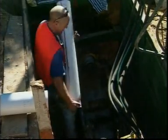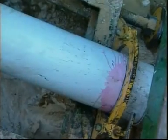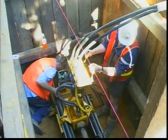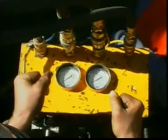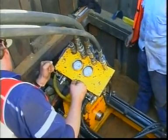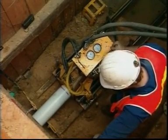No Dig Equipment can be used to install any type of pipe and services, including pipes up to 250 millimetres. The rig can be operated at any depth and in most locations. Boring can be accurately achieved for grades from 1 in 200 up to 1 in 5 and over distances up to 60 metres. The No Dig Equipment system is simple to operate and the company offers initial training and backup to new purchasers.